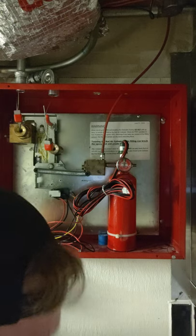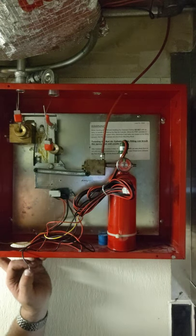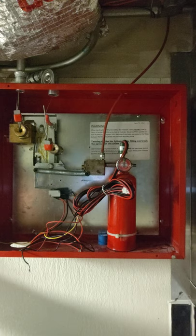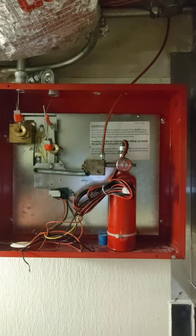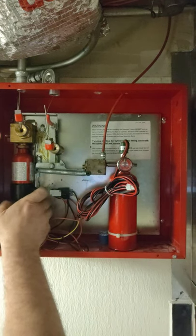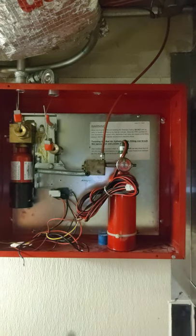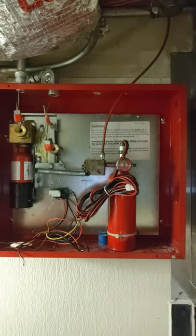If you're still a little bit nervous about whether you got this correct, this is what you do: I got the cartridge out, and the copper tubing that goes to the tank — I took that off. So no matter what, it cannot go to your fire system and dump it. So what I'll do is take this cartridge and screw this back in. That screwed all the way back in. Now if you'd screwed it in and that pin was still down, you would have already dumped this system or it'd be squirting out.